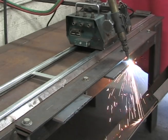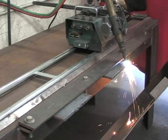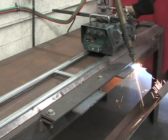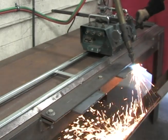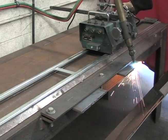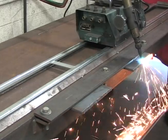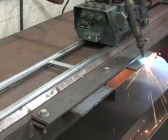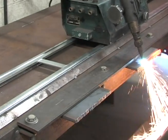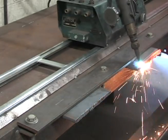He's going to have to make some adjustments as he's cutting — right now he needs to make a speed adjustment, he's going too slow. A little bit faster. There you go. What we're looking for for this particular test plate for the AWS D1.1 Structural Weld Code Test is a bevel angle of approximately 22 and a half degrees. We're using a track torch because it provides a nice smooth, gouge-free edge. It makes cleaning of the bevel a little bit easier and more precise than doing it with a hand torch.